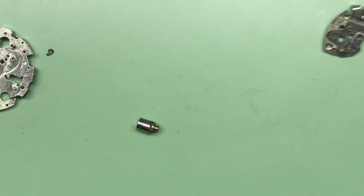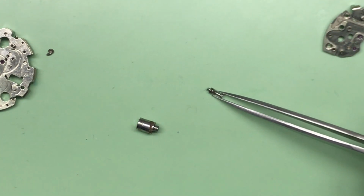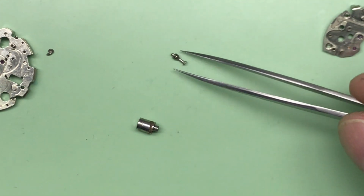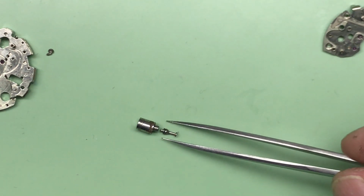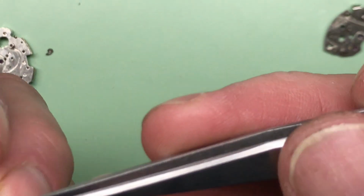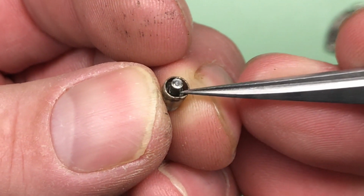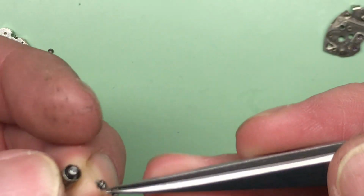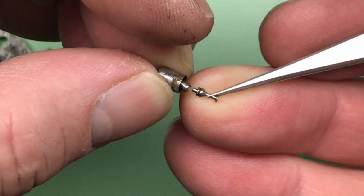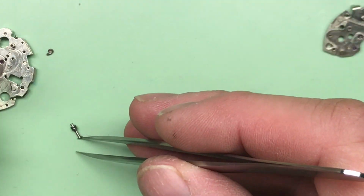Unfortunately, as I was taking your pusher, which was terribly bent and kinked, actually, as I was taking your seal off of your pusher, it broke. It's bent to the point where the pusher itself is bent. This little cone here is badly bent, and this apparently had gotten crimped at some point. This is the weak point. This is right where the seal goes. And as soon as I went to remove that seal, off it came.